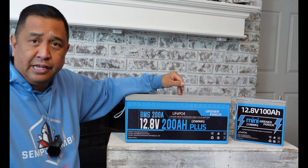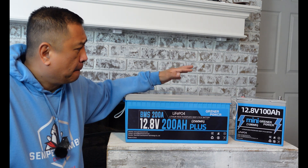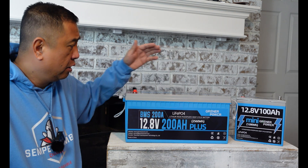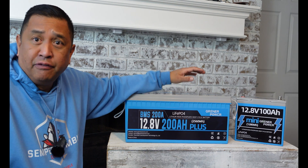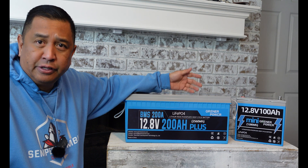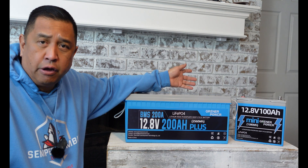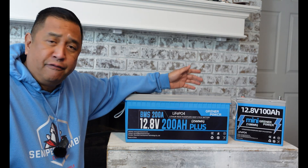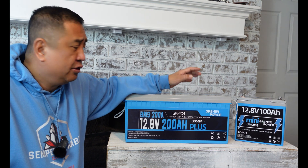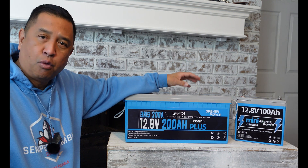The MPPT controller will control the power from the solar panels to the battery so you don't damage it. The biggest things you want to have are a battery shutoff and a fuse. This will go to the inverter, but between the inverter and the battery I will have a shutoff switch that can be turned off at any time to save power or when not using the system. That fuse needs to be between the battery and the shutoff switch as well, to protect your equipment in case of any electrical issues.